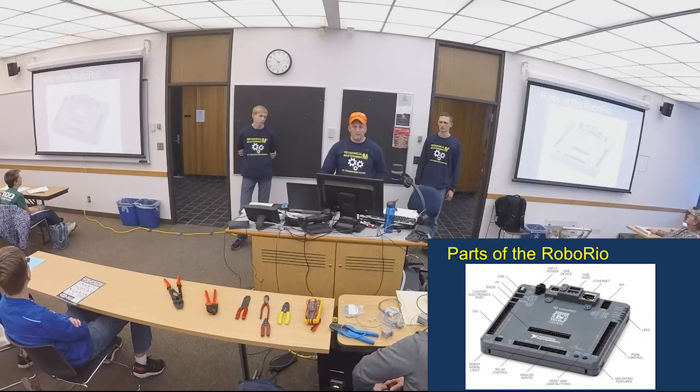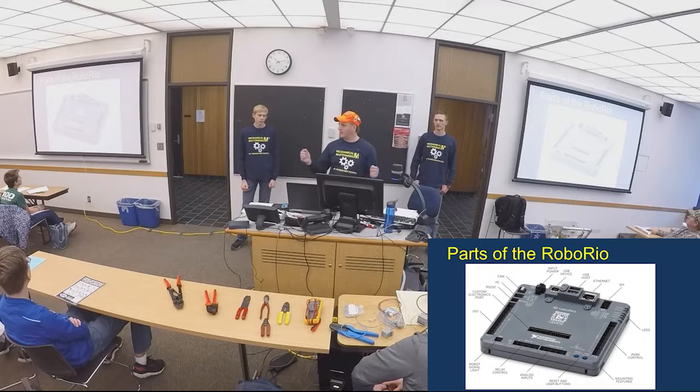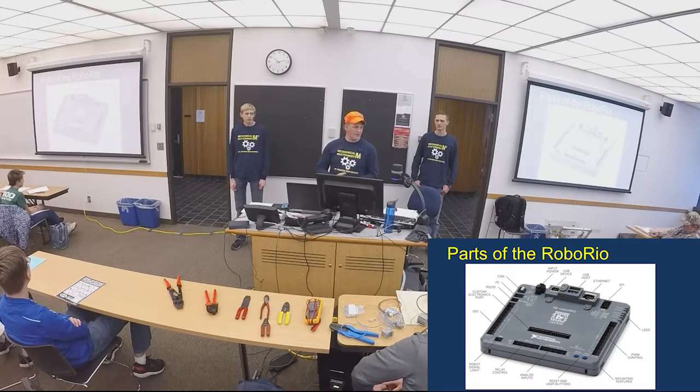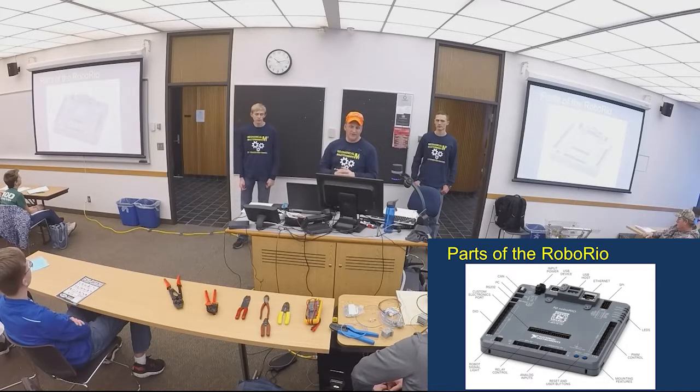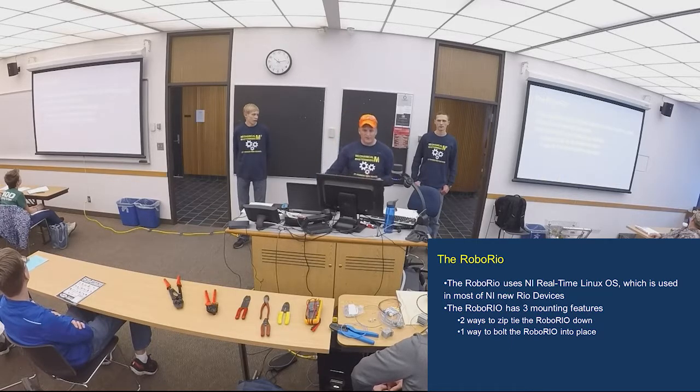We don't go in a lot of detail, but the roboRIO here, this is where Jake was talking about the PWMs, you see that on the right side of that, that's where all them cables got to go through. And there's a 3-pin connection on that. And when we look at designing our robots, we want to make sure the roboRIO is in a good spot as well. And wire routing is really critical where you want to run these. Because these are not very heavy gauge wire and they can bend and break and cause you nuisance issues on the field.